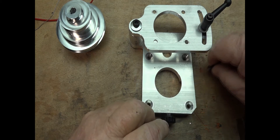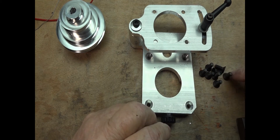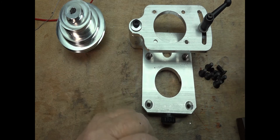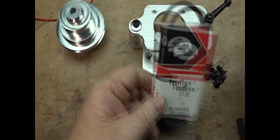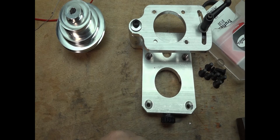And it came with these screws. I've heard before that these screws are too long for the motor — I will figure that out as the installation goes. Also, I have left that intermediate gear in because it still has a high speed to it. Should the belt break, I still get a little high-speed use out of my mill. But I did tighten up the shift lever so it's not going to move easy. And it comes with a belt — I do suggest that with anything you get with a belt, you always get a spare. So my next move will be to order a spare belt. And it's time to assemble this and I'll get back to you when I get the parts over here.